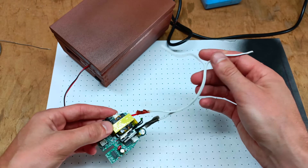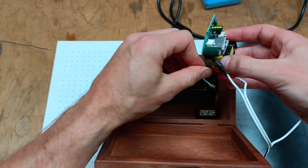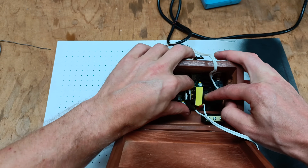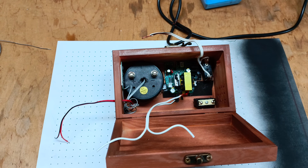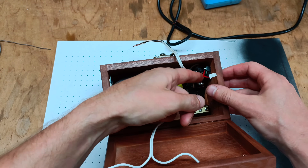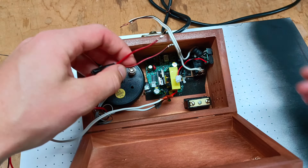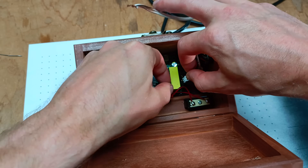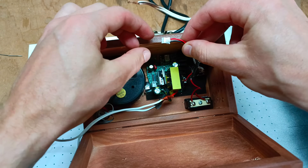Into the prepared case I mounted a voltage converter. This converter will transform the 12V DC from the lithium-ion cells to 220V AC. I attach the converter to the case using super strong double-sided tape and it is further secured with hot glue. Next I mount the USB port to the case and I am soldering the wires connecting the AC socket to the converter. Another crucial component is the fan which cools the electronics — I am mounting it with double-sided tape. All these electronic elements I am connecting to the main DC-AC converter, and of course all components will be secured with hot glue.